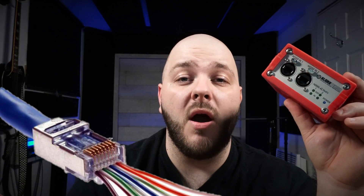With this device, you can extend your cable run by another 100 meters. You can daisy chain these boxes together pretty much as much as you want. Each box will only increase your latency by about five microseconds, so before you even notice a difference, you'll need a lot of cable and a lot of boxes.